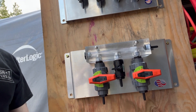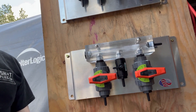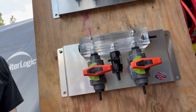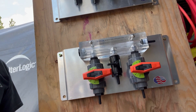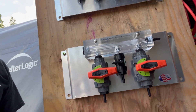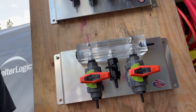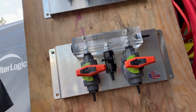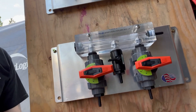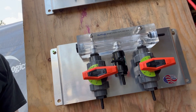The V3 has proportioning metering valves. The middle valve you would typically hook up to your chlorine, and the other ones you could hook up to different things at different percentages. You could hook one up directly to a strong mix of soap and meter it to choose how much soap is coming out. You could also hook the other one up to concentrated degreaser and choose what strength of degreaser you want to mix with your chlorine and soap.